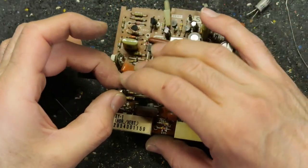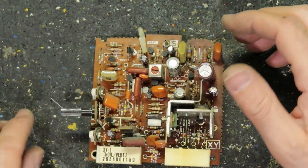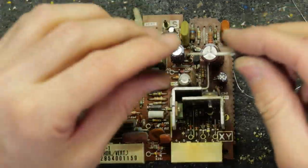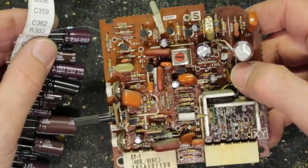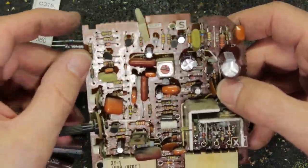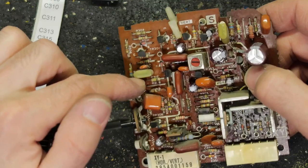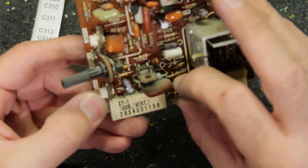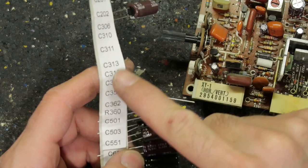We are at C15 — there's a marking on the top. Next up is C356, right here — this little guy right there. C59 is next, it's right there. C362 is right here. The next one is this resistor R360 — I tested it with my multimeter and it came in at about 25.5 ohms. This one measures about 27 ohms. I'm going to leave it — it looks fine, it tests okay, but it's so far in there it's not worth getting to.